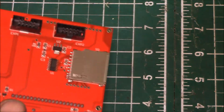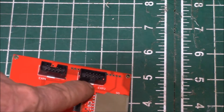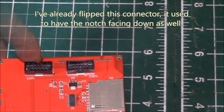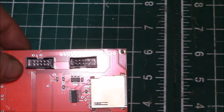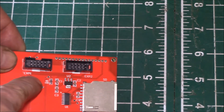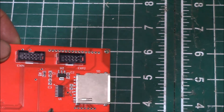It doesn't display anything. The problem is — see the notch on the connector and the notch on the silk screen? You can see this connector has the notch on the top. At the suggestion of one YouTube video, they finally explained what was going on: the silk screen is wrong. The connector number itself is correct, but the silk screen showing the position of the notch is wrong.